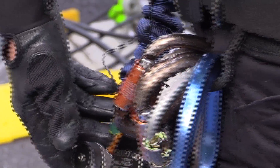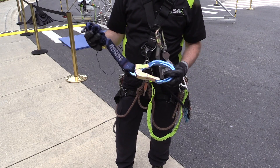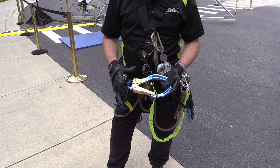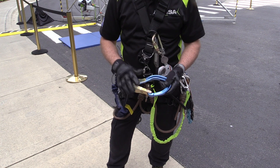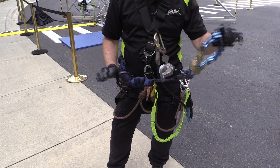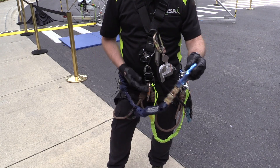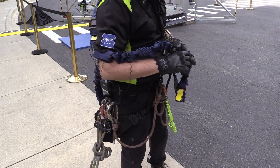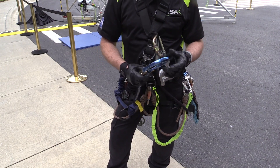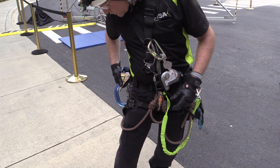The next major important part is our lanyards. We have lanyards attached to our sides. This particular model is from DBI Sala. All of our connections are at least double action — meaning I'm pressing on the back of it to release it and open it from the front, so you can't accidentally open it with a single press. This one also has a rescue ring, so if you were hanging from this hook, somebody could use rescue equipment to bring you up and release you. In the back, it does have a fall arrestor — that's what the little pouch is. In the event of a fall, it's going to absorb the energy of your fall, disperse it, convert that to heat, and keep you from having so much shock on your body.